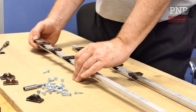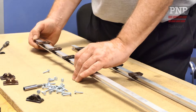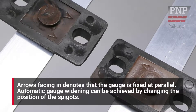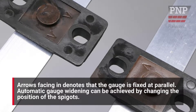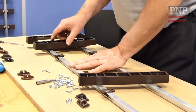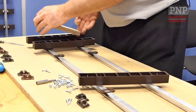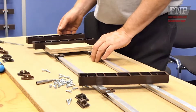It is very important to note the direction of the arrow. For 5 inch gauge you will need to place the spacers in the chair with the arrows all facing inwards. Place the spacers onto the back of the chairs, positioning at approximately 100mm centres. You may want to make a simple gauge for this process, such as a block of wood.